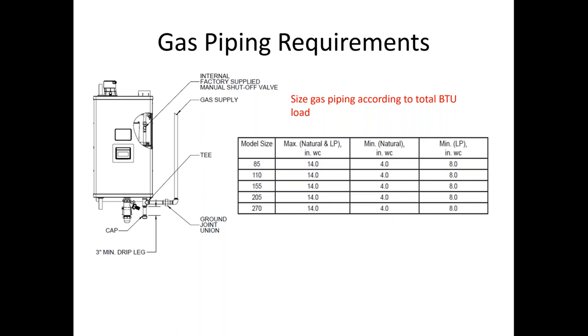The next portion is gas piping requirements. We need to size gas piping in accordance with BTU load, with minimum and maximum inches of water column for these products to run correctly. A real-life story: I've run into issues seeing only the static pressure — putting my manometer on and seeing it hold at five and a half inches of water column and thinking the boiler should fire. We also want to check dynamic pressure; turn other fixtures on. In one case, whenever the boiler would go to light, the gas line was dropping into a negative — it was a faulty regulator and a bad meter.